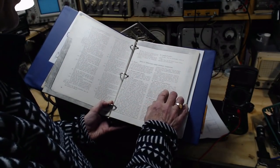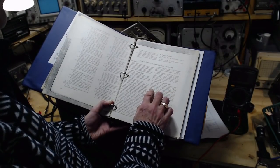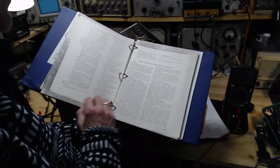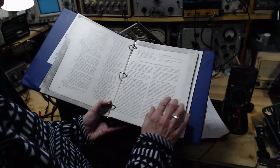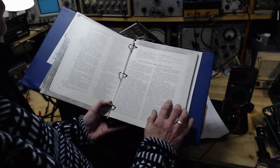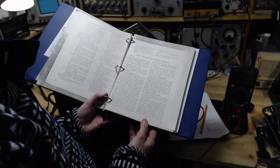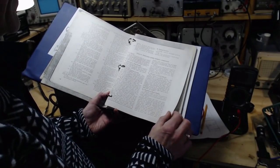When equipment is installed below ground and when it's set up in a swampy area, moisture conditions are more acute than normal in the tropics. Ventilation is usually very poor, and the high relative humidity causes condensation of moisture on the equipment whenever the temperature of the equipment becomes lower than the ambient air. To minimize this condition, place a lighted electric light bulb under the equipment. Wait a minute. You're trying to hide from the enemy, and you're sticking light bulbs under your radio? Doesn't that kind of counter...